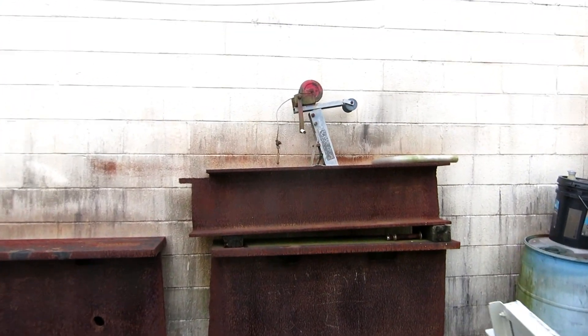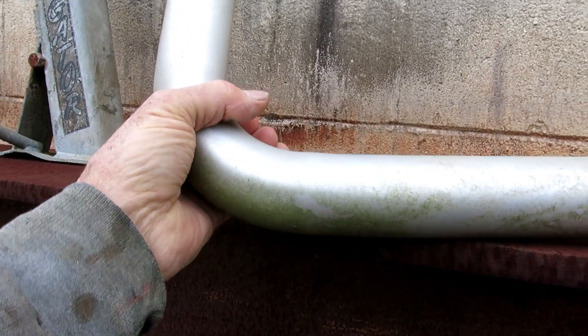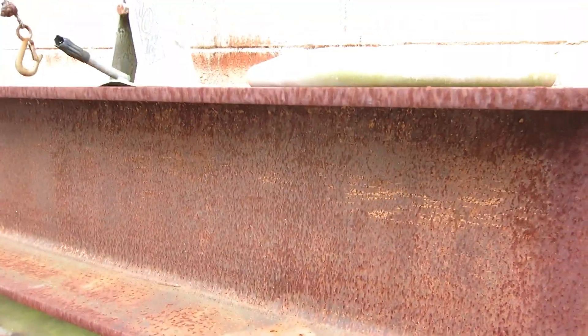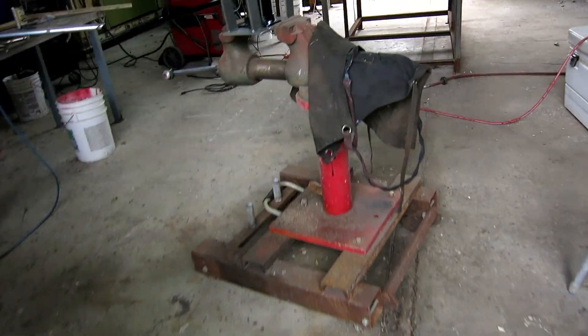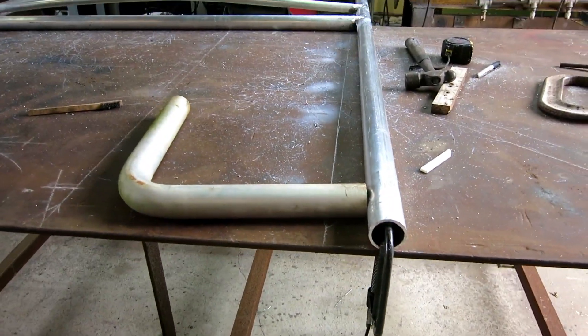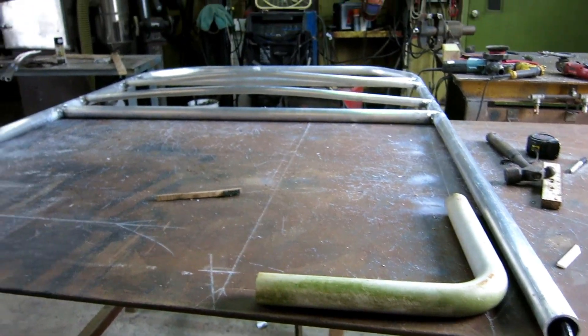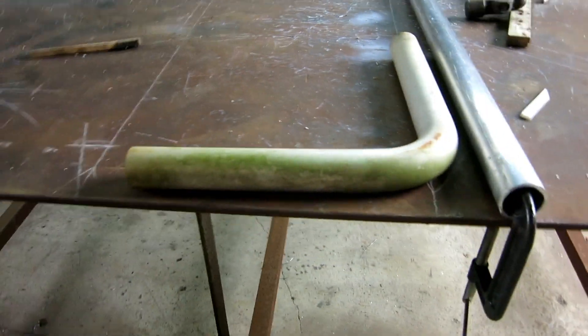I looked over and saw a piece of aluminum I'd forgotten about - I found more of them stored behind my big sawhorses. This is actually two-inch tubing, which means it's two inches on the outside, and I'm using inch-and-a-half pipe which is 1.9 on the outside, so it's not an exact match but it's going to be very close. I'm going to use two of these for the back corners, and I'll still have two more for tying the T-top to the console. I'll make the back come around with these two nice factory 90s.